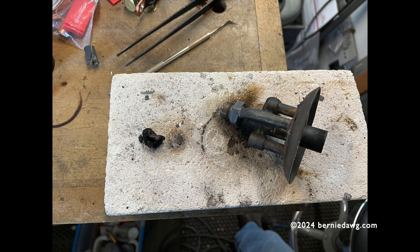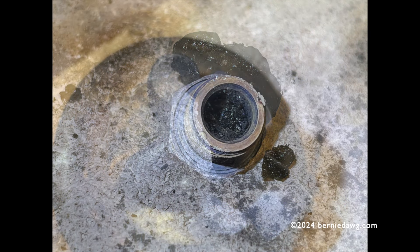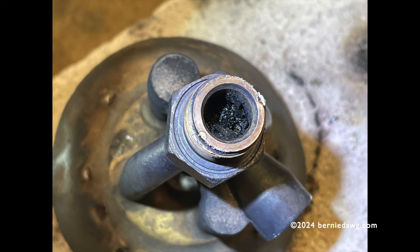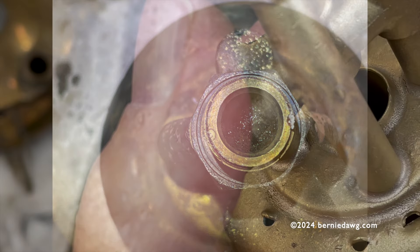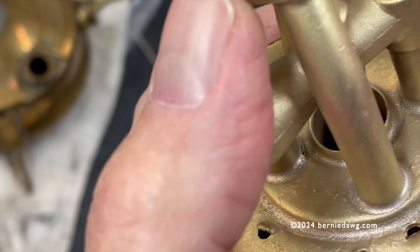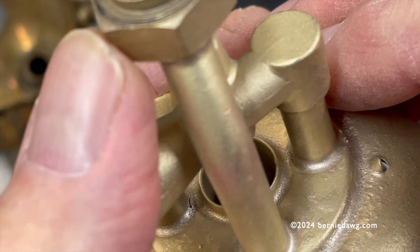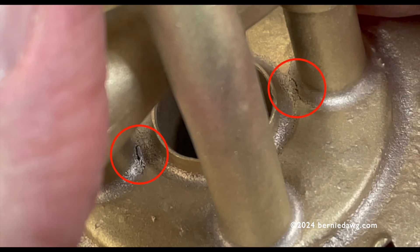Got all our burner parts in there. I went ahead and cleaned this just by heating the burner on this ceramic block. You can see this gross stuff that bubbled out of the base of the burner — I'm not sure what this stuff is, it's pretty weird. You can see some still in there. It took a lot of work to get all that crud out of the burner, mostly mechanically. And then this is after I bead blasted the burner to clean it all up.